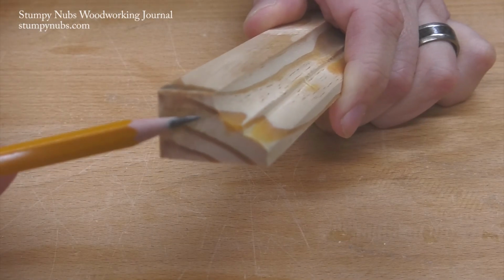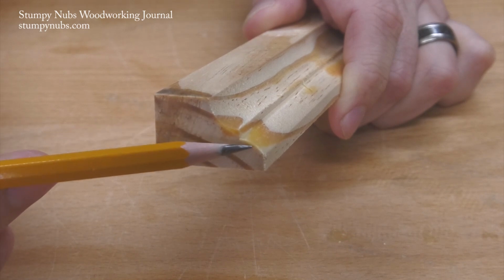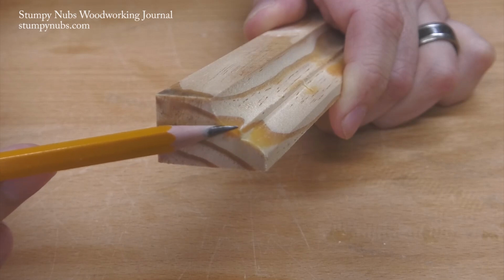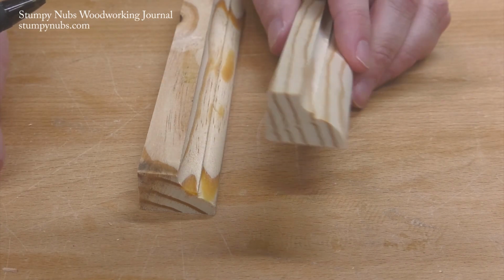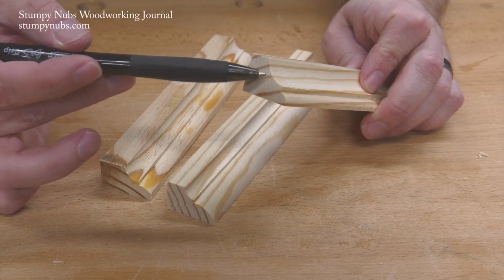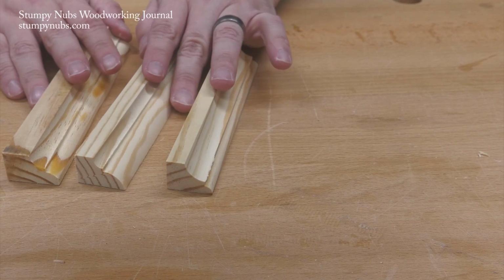These bits commonly feature a 5/16 inch cove and a 5/16 inch round separated by a 1/16 fillet. What if you reduce the cove to 3/16 of an inch and enlarge the round to a 1/2 inch? That would dramatically change the profile. You could do the opposite as well. Place a smaller cove over a larger round.